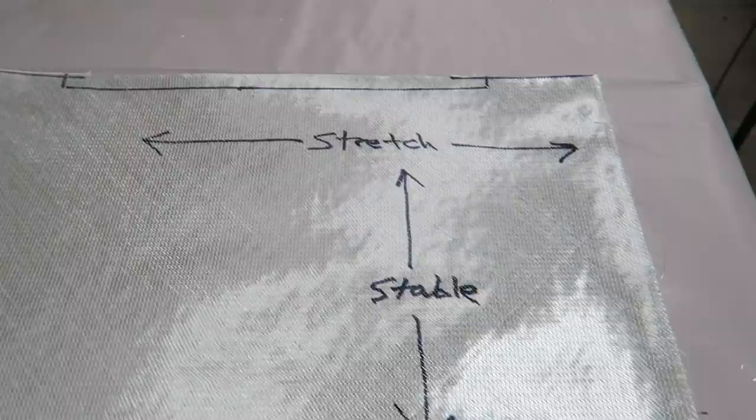And the reason for that is because 1708 behaves differently depending on the orientation in the way that the material is being worked. Now, just as a real quick example here, think about when you're wetting this material out. You're using a roller, or at least I'm going to be using a roller because of the size of the area. But you're going to be using a roller, and you're trying to force the resin down into the glass and all the way through all those three layers. Well, so as a result, you're going to be using a fair amount of pressure on the roller to try and work that resin into the fiberglass. Well, when you're doing that, depending on the direction that you're rolling it, you're also stretching this material somewhat. And 1708 is a lot more stable in one direction versus the other.